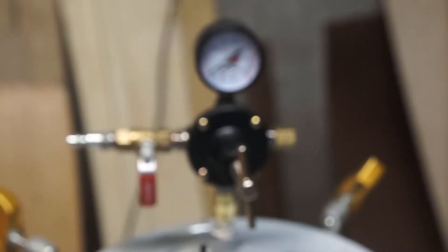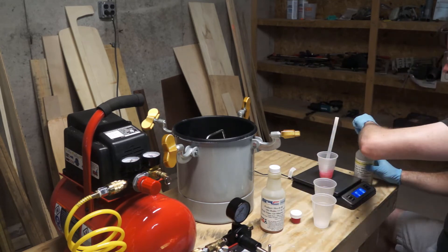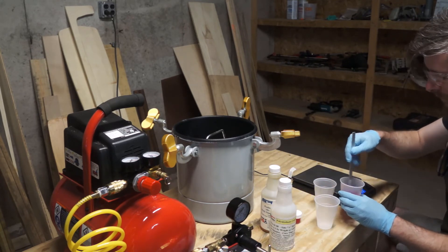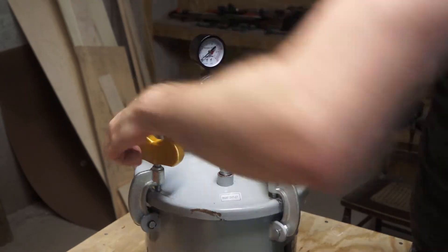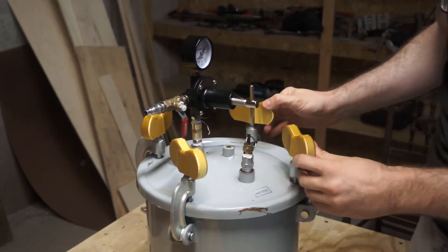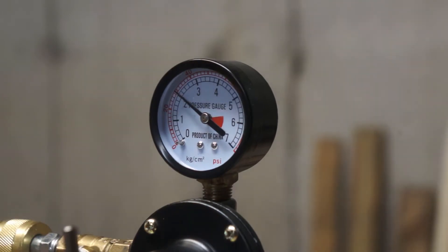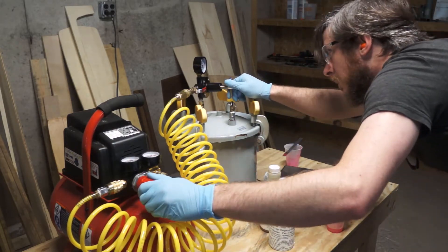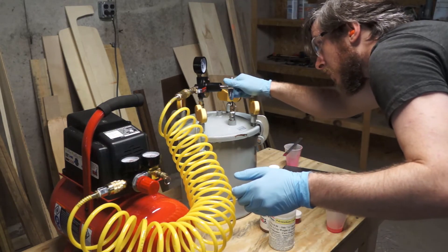Will pressure casting urethane rubber get us a bubble-free cure or not? So instead of trying to get everything perfect I quickly reassembled all of my pipework for the third time — back to using Teflon tape, just trying to do a quick test. I mixed up a batch of resin and poured it into two cups — one will sit outside and cure normally, and the other will go into the pot and cure under pressure. I clamped the pot shut, hooked up the air, pressurized it — and it leaked. But I was expecting that. To get around the leaks, I'm leaving my air line connected and letting my compressor regulate the pressure on the whole system. As air leaks out, more pressure can be added to compensate, keeping the pot pressurized while the urethane cures.